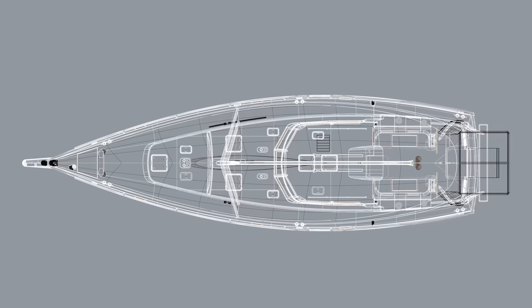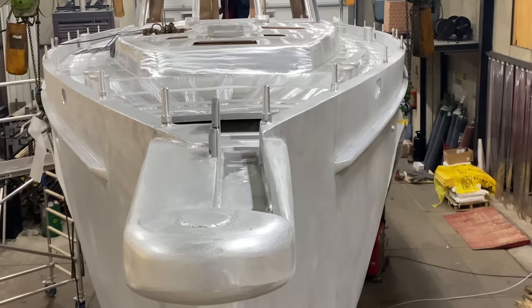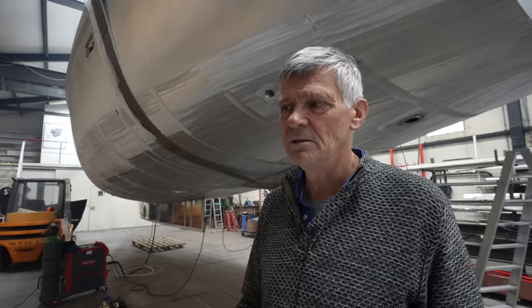We check that with the design, the drawings, and the calculations, and we can see the quality of the welding and the general correctness of the structure. That's not possible anymore once everything is insulated and covered in PU foam - that's why we have to look now.